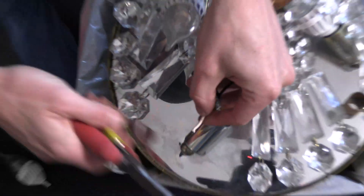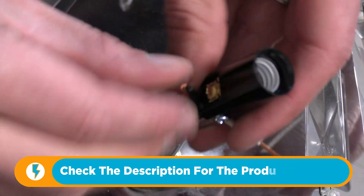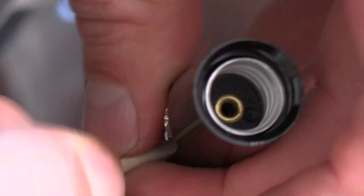Let's strip these connections back and seat them in our terminals. I'm going to drop a link in the description. This miniature kind of socket is called candelabra, and that's exactly what I searched — replacement candelabra socket on Amazon. You can often find these parts at your home stores; there'll be a lighting repair parts section on an end cap in the lighting aisle at Menards, Home Depot, or Lowe's. Now this is a very low power connection with a very small screw and lightweight metal, so take precaution — you're not shooting for a death grip, be gentle. I'm going to wrap it around righty-tighty to match the direction I turn the screw, and pre-twist my wires — give that small stranded wire a shepherd's hook by hand.